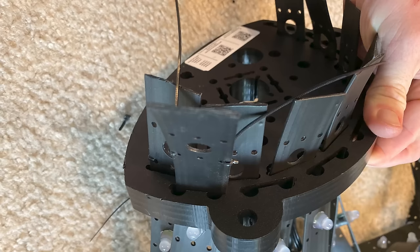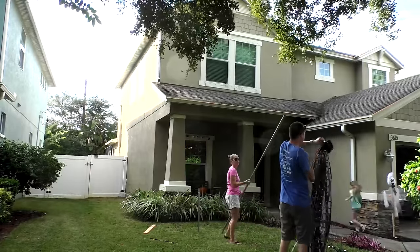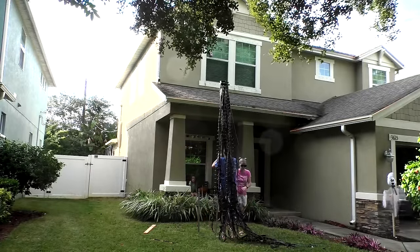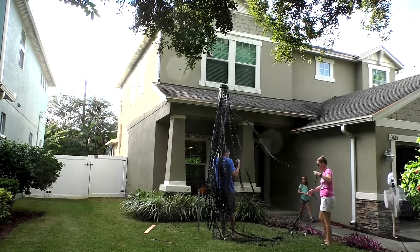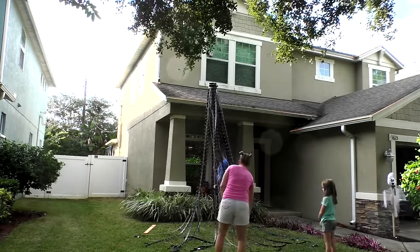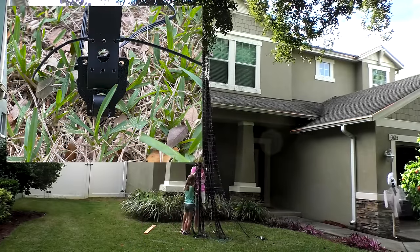The mega tree comes with a milled plastic top piece that has slots to hold the pixel mounting strips using zip ties. Put each strip into the top mounting plate, making sure that the pixels are facing outwards, and tie on some length of rope to act as guy wires. Slip the mounting plate over the top of the uncut piece of rail and lift it on top of the section you pounded into the ground — it's helpful to have a second set of hands here to untangle the strips while you hold the pole in place. On the bottom of each strip there's a strain relief piece that gets attached by looping the strip around and securing it with a few zip ties.